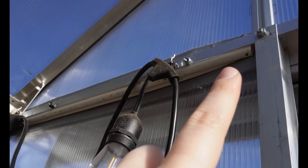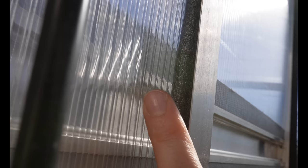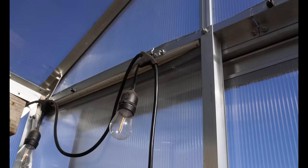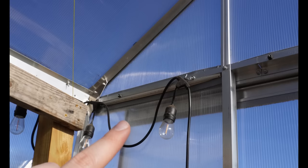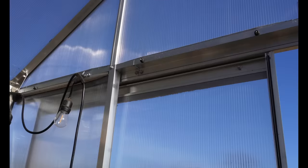One last thing I wanted to show you is the weather stripping. You can see this white strip up here and behind here I have foam insulation along the gaps between the polycarbonate panels and the aluminum frame. I got these in the insulation section at Lowe's or Home Depot and tried to close in all the gaps where cold air was coming in and warm air was escaping — putting that foam insulation all along the gaps, along the roof and in between the panels.